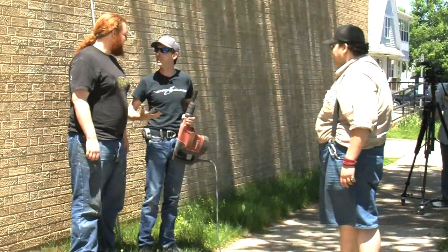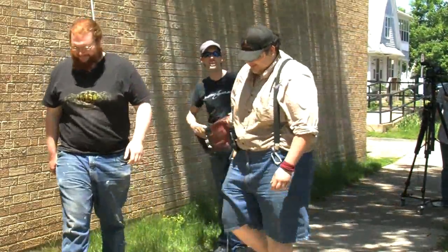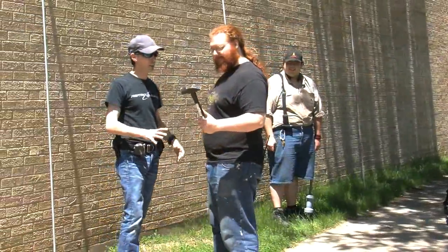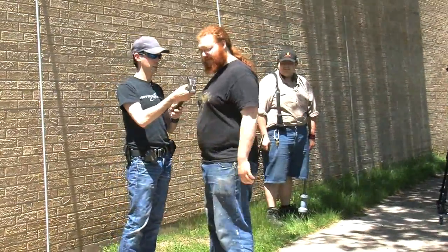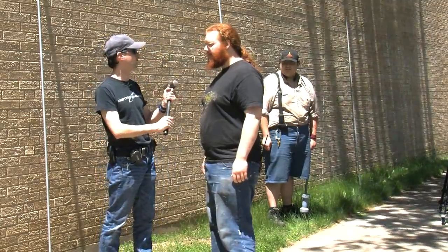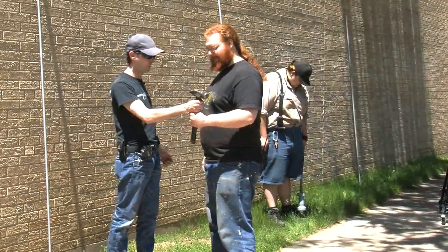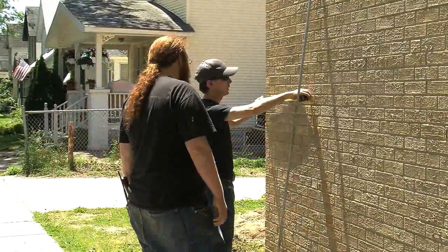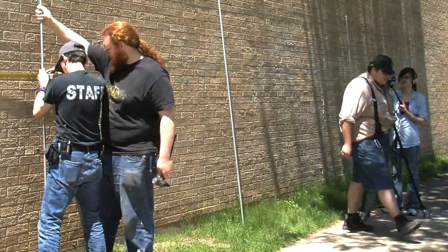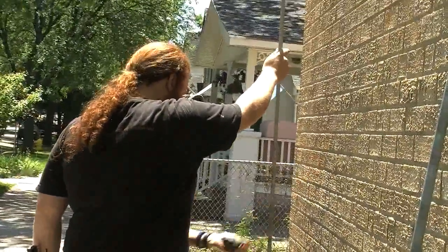Now you are by far the biggest, burliest guy here, so this is somewhat fair. You go grab your hammer, you go grab the slide hammer, and I'll meet you gentlemen back here in a minute. All right Dave, come on in here — we're going to get started with you. You picked any hammer in the building, and you've got this. What do you got? Mini sledge — about a four or five pound sledge? This is the way that most people at home, if they just have to drive a ground rod, are going to do it. You are the mighty Scotsman, so we're going to give you the hammer. We're going to start the first one three feet off the wall — want to be about six inches off the building, otherwise we'll hit the footer. Go ahead.